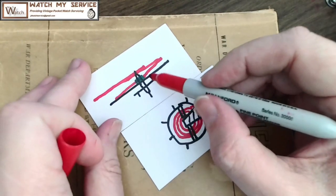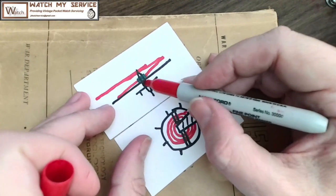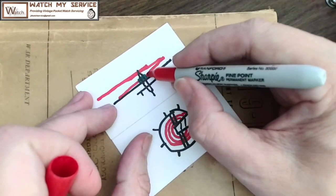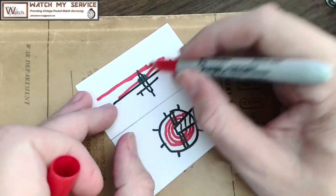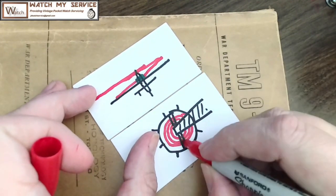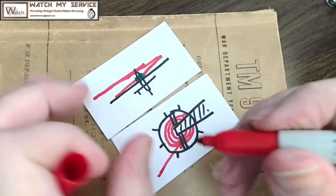And when this is now at an angle because it was either studded improperly, or when you put it back on the balance, or when you staked it back onto the balance staff, for some reason you touched that hairspring at the stud, and it bent that way, so it's at an angle for some reason, that is going to touch the arm right here, right? That's going to touch that arm right there.